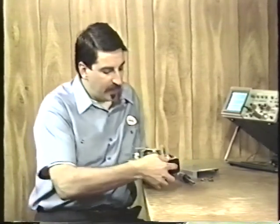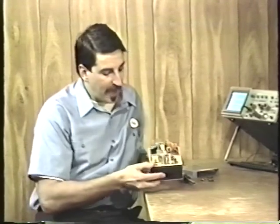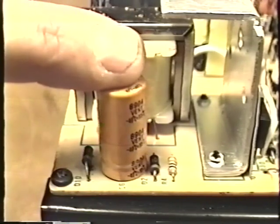Look, over here on the other side of the switching regulator power supply, you'll see a small transformer. This transformer gets its input from the 115 volts AC and gives us an output which is rectified by a pair of diodes and filtered by this filter capacitor. This creates a power supply of around 16 volts DC, which is then used to power the integrated circuit itself. Also, adjacent to the switching transistors, you will see a pair of diodes. These diodes, which are known as the clamping diodes, are kind of a protection device that keeps the transistors from blowing out.